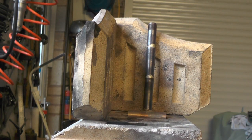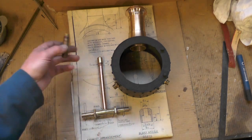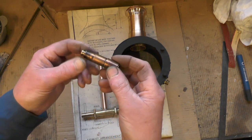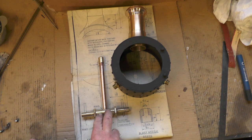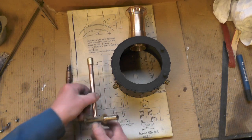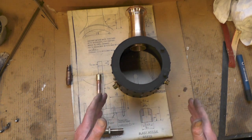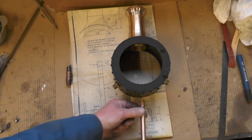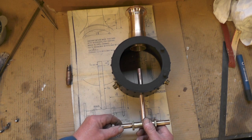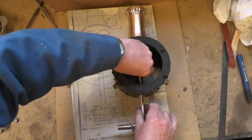I'll just let that cool down naturally and clean it up. That's my exhaust arrangement completed with a blast nozzle on - all made from recycled motorcycle valve guides, one two three four five, and then a little bit of five-eighths brass in the middle and two locking nuts. Imagine your frames are here and the smoke box on the loco - I've just painted my smoke box. This is going to sit between the frames, and then the blast pipe and blast nozzle will just screw on top.